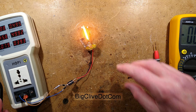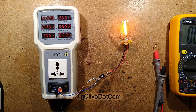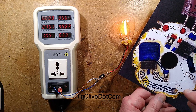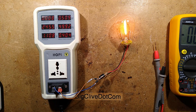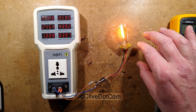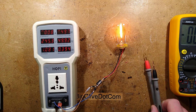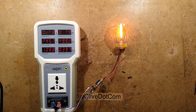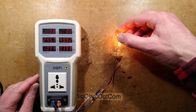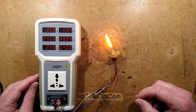You could use the same surface mount circuit board but just put a little cluster of resistors in place of the linear regulator and it would achieve the same thing. Likewise, you could use two filaments, though the voltage drop across the resistors would be more critical and you'd be more likely to get slight fluctuation. This is that warm golden colour temperature, which also impacts the intensity. It's notably just a bit brighter because of my circuitry driving at higher current while still maintaining roughly a watt.